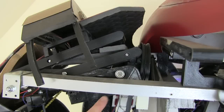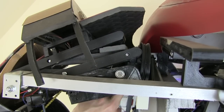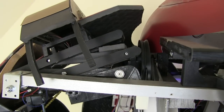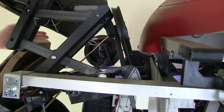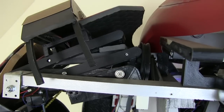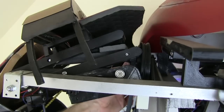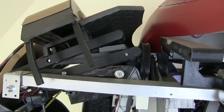I've powered this up now. You might just be able to hear that servo buzzing away — that's the main lifter servo. If I press a button it will lift up, open and fire the LEDs — you can just see them flashing away there. And it shuts again. But the servo is really unhappy — I don't seem to be able to get it to home properly. So let's have a look at some relays and things we can use to cut power.